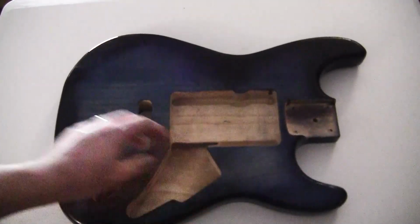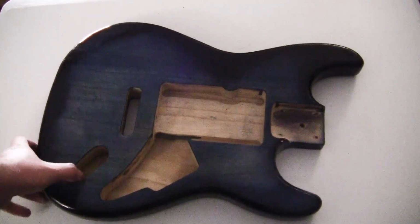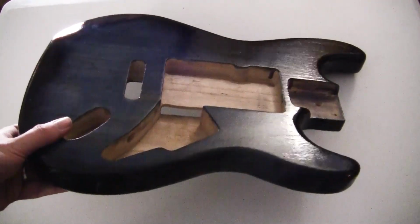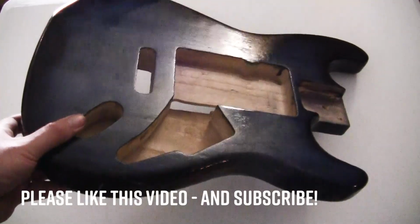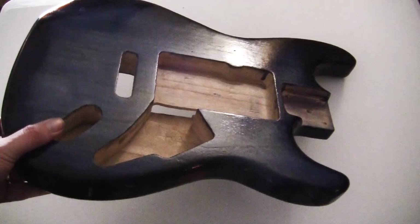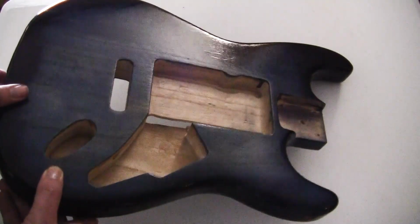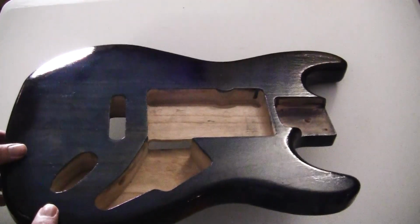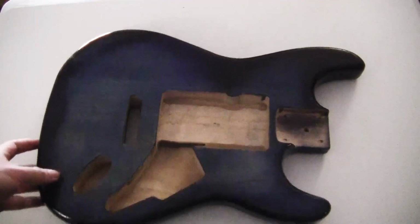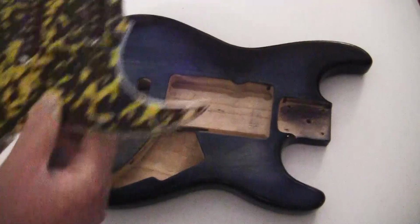And I've been adding several coats of polyurethane to this since then, which you can see is the sheen that's on it. So I have a couple more coats on that to go, and then I'm going to sand it out to make it flat. If you can see here where that big spot is, you can still see it in the surface. So it's never going to be completely smooth. This guitar is simply not worth the effort to get a complete glass-like finish on it.